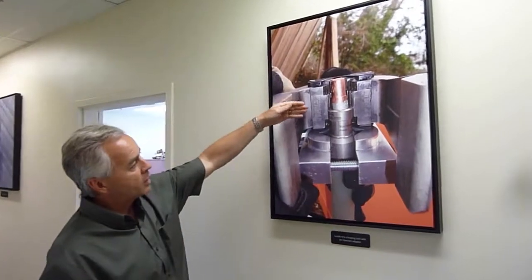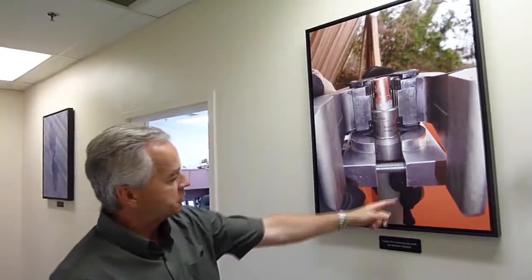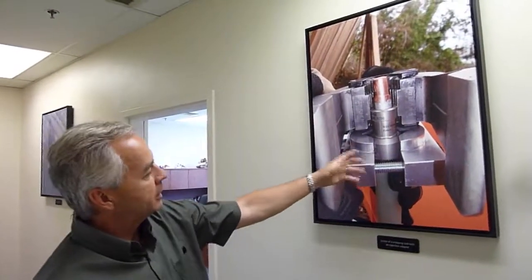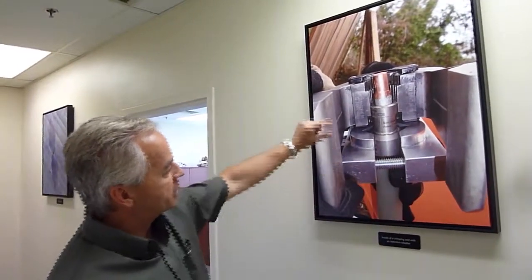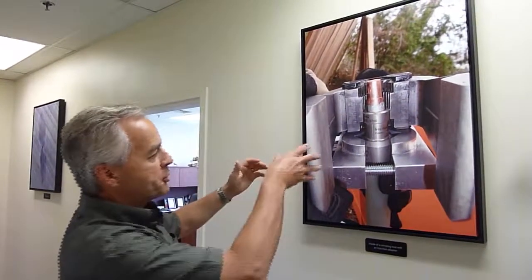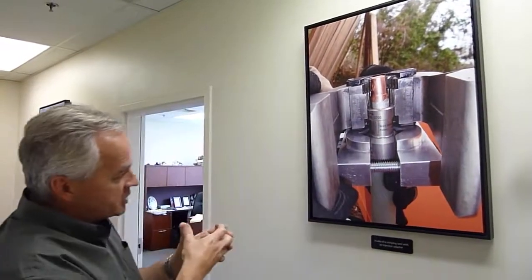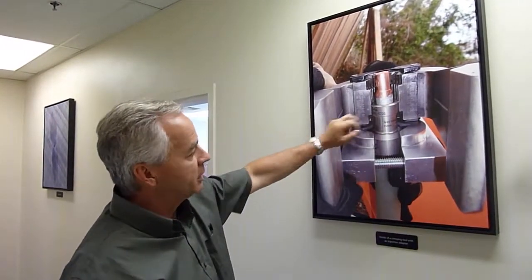So that picture shows the swage kind of happening. And this picture shows a cutaway. We took out one of the dies, so you just see half. And so it just shows you how it all lines up. The gentleman's fingers are down here holding on to the cable, and there's a special tool stop because you've got to get this position in exactly the right spot. So everything's lined up perfectly, and of course the other half has to be in there, and then the swage occurs. And this piece of metal right here will be squeezed down, and it'll be the same diameter as this when it's through. This one is stainless steel, so it's a lot of force, 45 tons of force to make that squeeze happen.